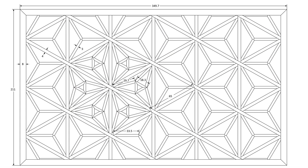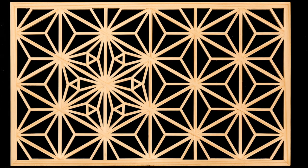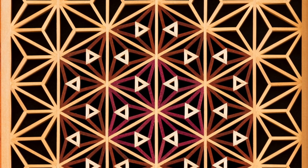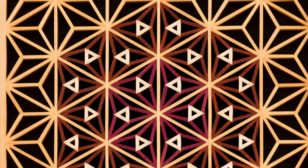The key aspect that you'll learn here is how to cut the Jigumi to size and how to attach the Tsukeko. This is a totally different process than that for the square Jigumi, and once you know how to do this, the possible uses are endless — not just art pieces, but anywhere you have a frame and panel you can insert a Kumiko panel that's as complex or as simple as you like.